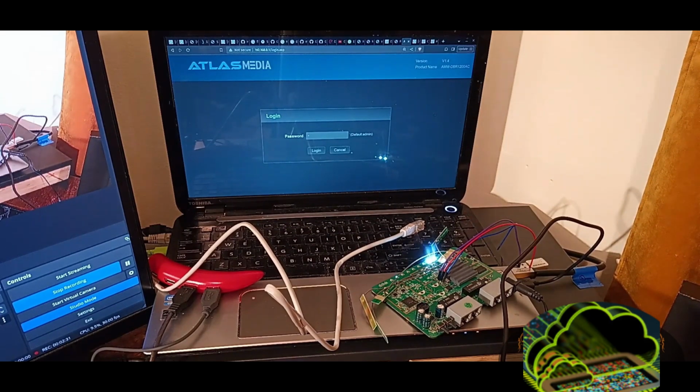There's also a lot of troubleshooting benefits to UART in that you actually see everything on the console from boot, and you see some information that even the operating system will never actually see, things that happen before the kernel is loaded. So there's advantages to development, but there are also other reasons to play around with UART.